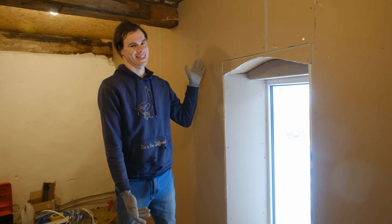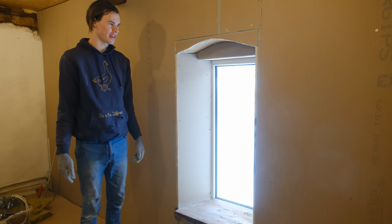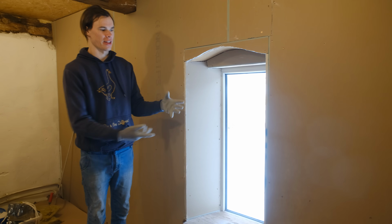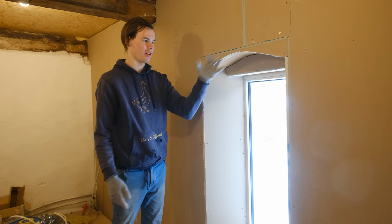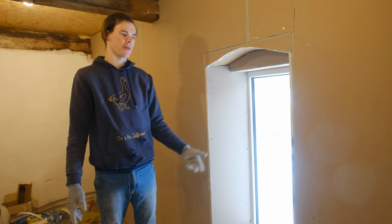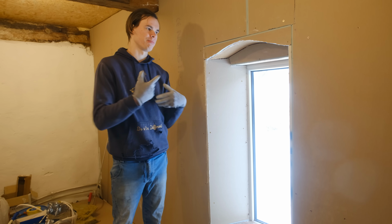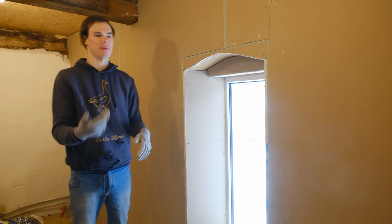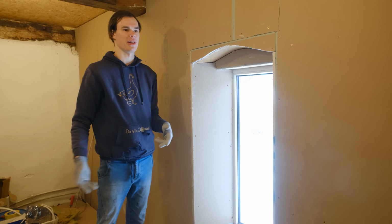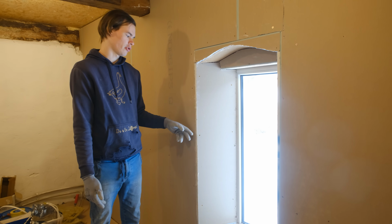So we are done, and as you can see, that's the ending of this stage, not the ending of plastering. Still have to plaster everything, fill in all the gaps, and then sandpaper it. Maybe you're gonna need sandpapering, then plastering again, because sometimes you plaster it and you don't see how deep you have plastered it, so you can do another layer. Because plastering is something that you can't do too big of a layer or it cracks. So you might need to do it twice.